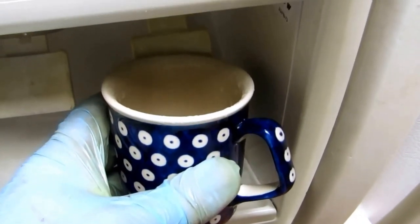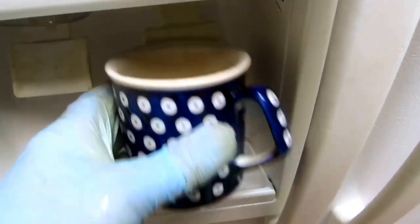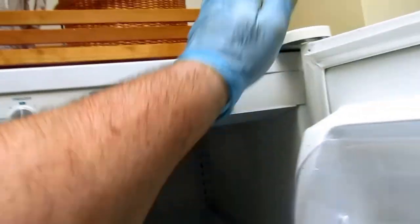I got the heat off, I got the heat pump shut off. I got the water heater electric off, which is important. This refrigerator is all stripped down — there's no ice in it, this thing's empty. What I'm going to do is unplug it and leave the doors open. If not, it'll get all moldy in there. A lot of times I'll put rags in here so nobody can come along and shut them.